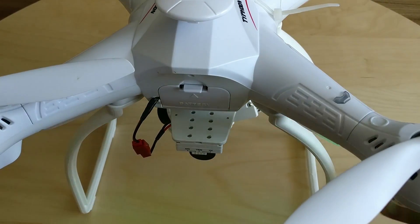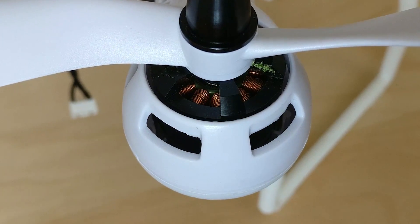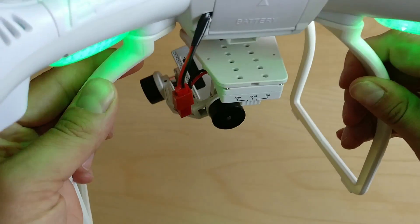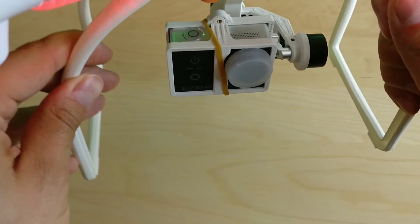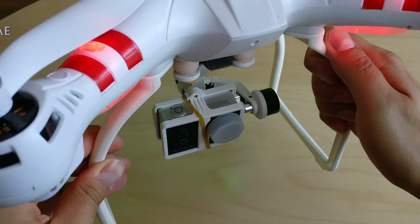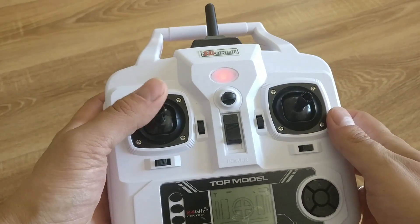The gimbal motors are quite powerful brushless motors — much more powerful than motors running at 7.4 volts. The thrust here is just amazing. You get 450 grams of payload support. An action camera weighs around 70 to 90 grams, a gimbal is about 200 grams, and it can easily carry an action cam and even something bigger.